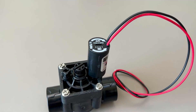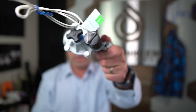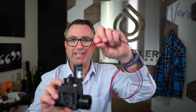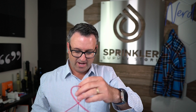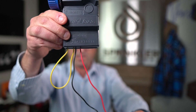It must be a DC latching solenoid. Looking at the different solenoids here, some have all black wires, some have all white wires, and the Rainbird one has matching black and white wires. But the DC solenoid has red and black wires because a DC solenoid has polarity, so you need to match the red wire on the valve to the red wire coming off of the battery operated controller.